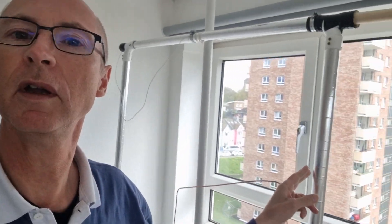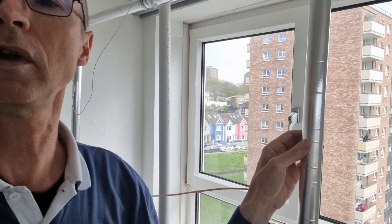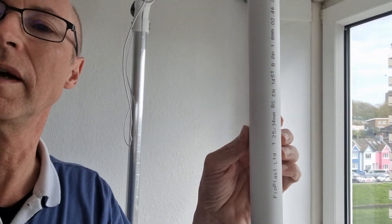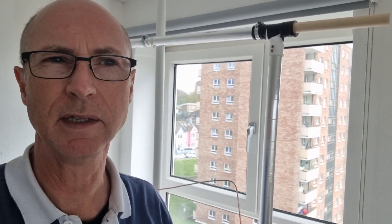Each of these sides of the loop is 1 metre long. I took 32mm drain pipe which is white plastic from the building supply shop and coated it in aluminium foil — this is 10cm wide aluminium foil which you have to wrap around the lengths of the tubes. Unfortunately the tubes were 2mm bigger diameter than expected, meaning the foil wasn't wide enough by about half a centimetre, so I put two strips on each one to cover the gap and it works very nicely. Transmitting with 50 watts I can get into Germany, Spain, and Sweden with strong signals when the band's open — at the moment propagation is no good at all, which is why I'm making this video instead of using the antenna.